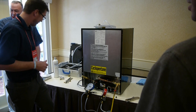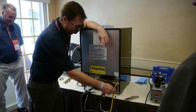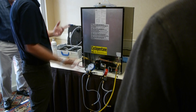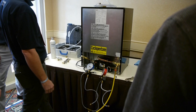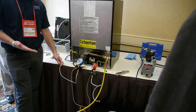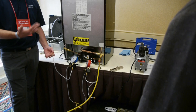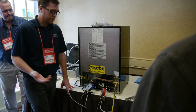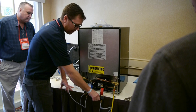We just let the discharge continue. The compressor is still running — you're using the pump to help push it out. Open up the door, get some more ambient temperature in there to help. I have the gauges hooked to the system, low side and high side. I could hook directly onto the low side right now — I'm discharging everything out anyway so I'm not worried about contaminating the system. I'd still hook it up just to monitor and verify low-side pressure during the discharge.